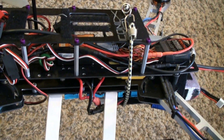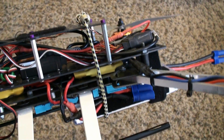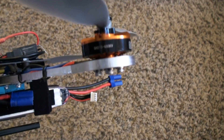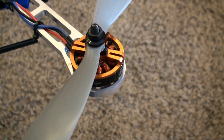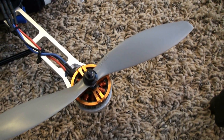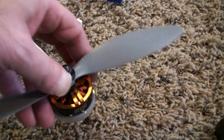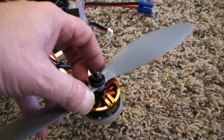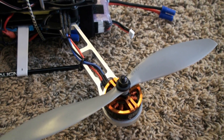My Iconic X consists of, on the frame for this flight: it's got the NAZA V2, the orange version. It's got 30-amp ESCs — they're Hobby Wing — and you can see them up inside the frame, they're the yellow ones. The motors are 650 kV and they are 42 by 15 millimeter — the pancake type or style. They work really nice because they don't spin as fast. The craft doesn't have as much raw power as it does with the 28-series motor, but these act like a big flywheel, which is a little more forgiving if your propellers are out of balance, and it helps keep the craft even especially on descends.